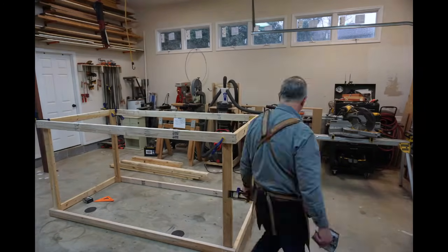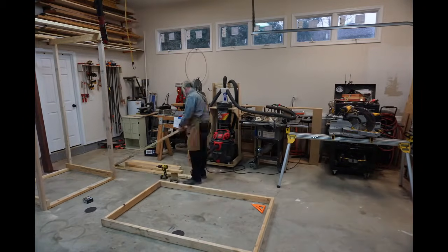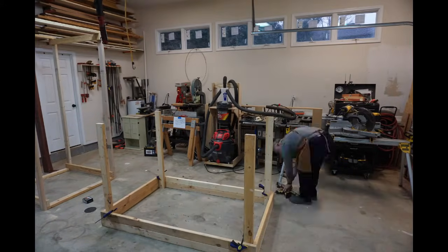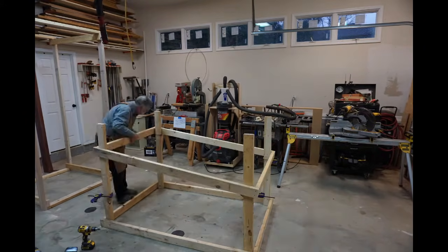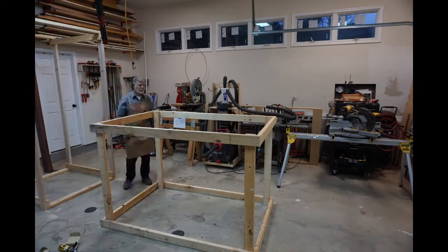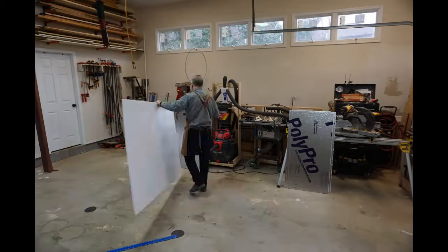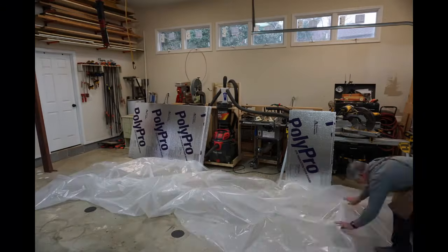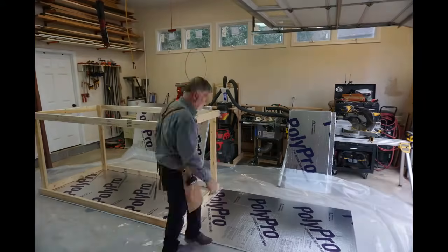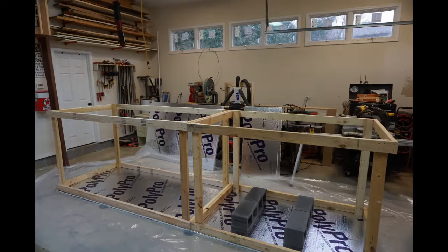I built the frame from two by fours. Since my target length is 14 feet, I built the frame in two sections: the first section is eight feet long and the second section is six feet long. After I assembled the frame, I cut four foam boards to six-foot lengths. The offcuts were used to insulate the ends of the kiln. I cut two 20-foot lengths of heavy-duty plastic, laid one piece out on the floor, then laid down the bottom insulation boards. I placed the wood frames on top of the insulation and secured the two sections together.